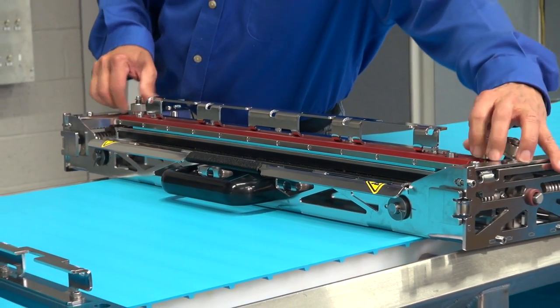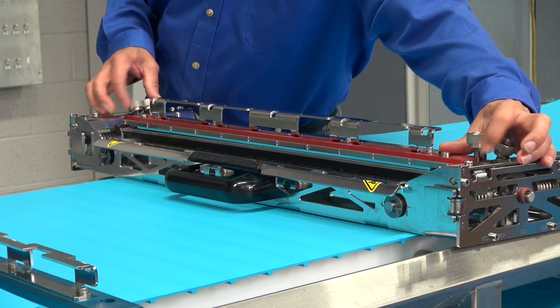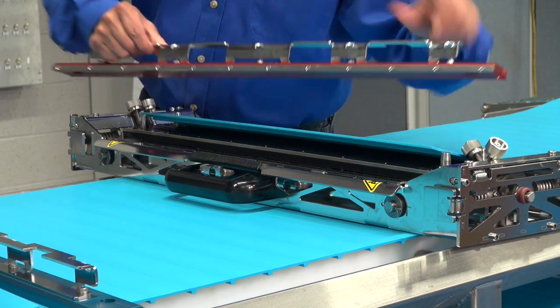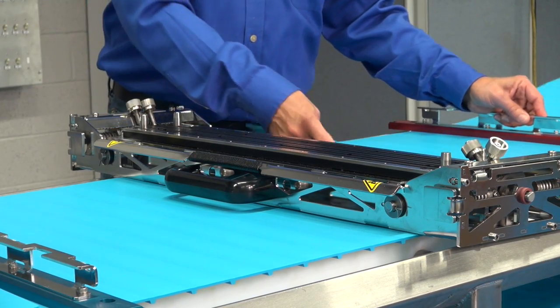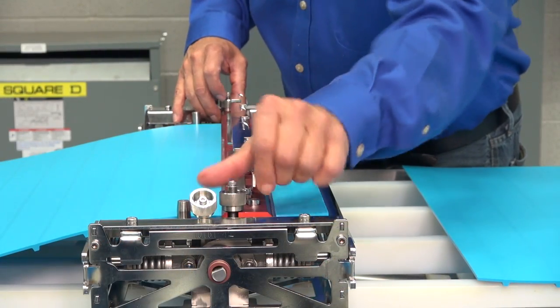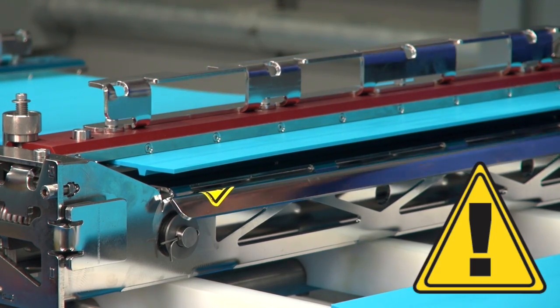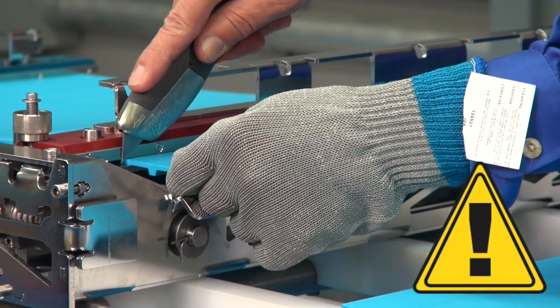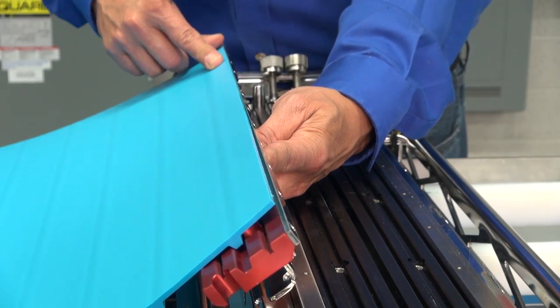Now one belt end is prepared and what has been cut off is waste. Loosen both thumb knobs, remove the cut guide and rotate it 180 degrees so it is in position to prepare the next belt end. Remove the prepared belt end carefully, remembering to keep both surfaces and edges clean. Pull the second belt end across both groove decks, position it and secure it with the cut guide edge facing outward just as you did for the first cut, and follow the same cutting procedure. A diagonal cut will cause a faulty splice, so carefully inspect the belt end cut for straightness and 90 degree corners using a square edge.